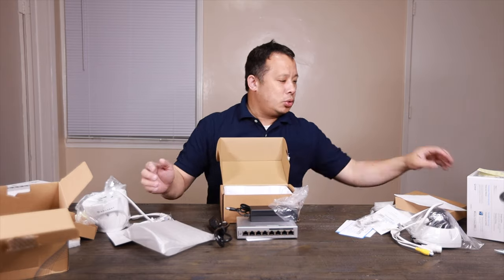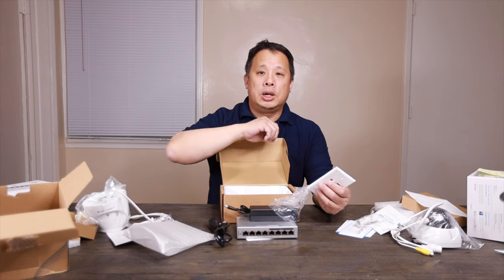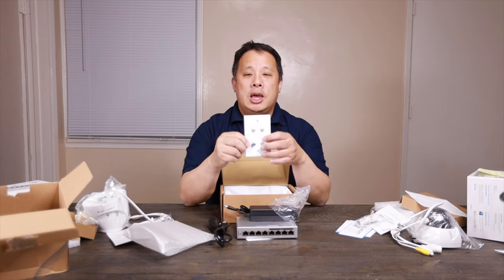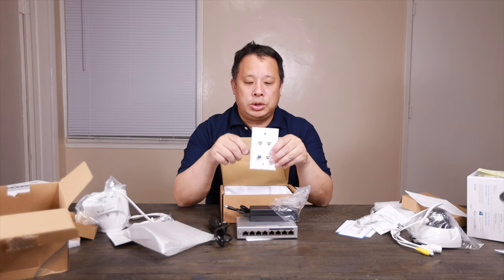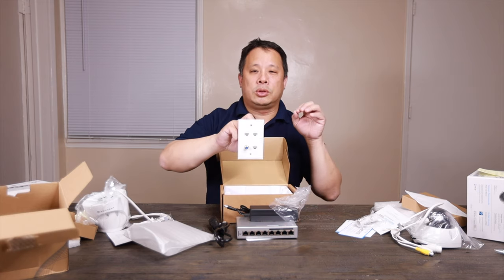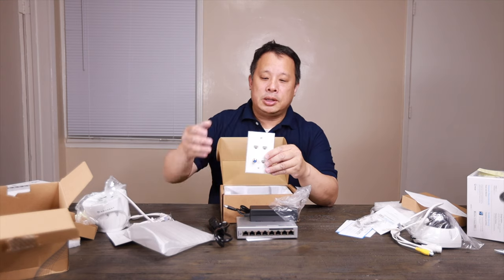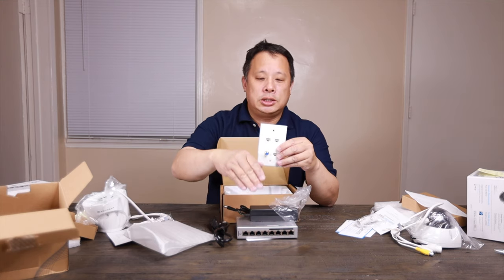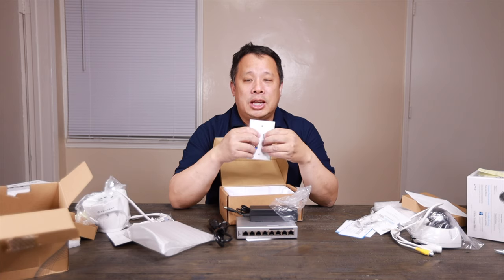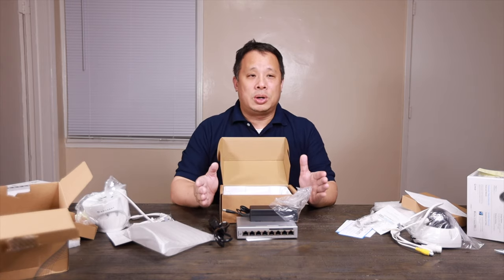Here's my design plan: the camera connects via RJ45, mounts to the wall, goes through an outside wall box, then a wire runs RJ45 into the house to an inside wall panel next to coax. That coax connects to the regular cable modem, and the three camera ports go to this PoE switch, which then connects to my regular Synology switch that has a link aggregation function. Everything will be set up nicely and functionally.